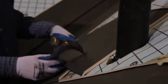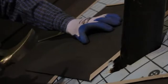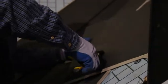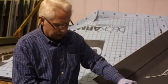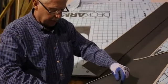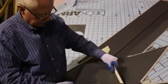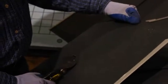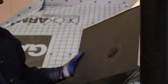As I do in other cases, it's easier to make that first cut through the roof just with a hammer claw. So I'm going to make that first. And to be able to cut with a pair of snips, just keep going in a circle, and then your waste material lifts up out of your way. Okay, there's my opening.